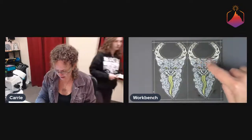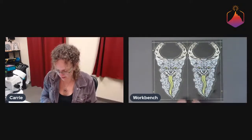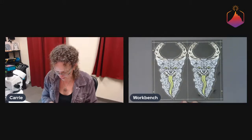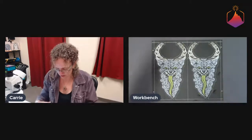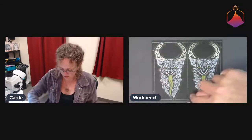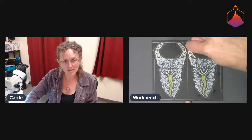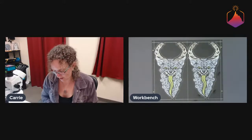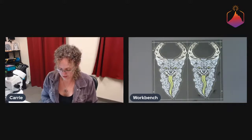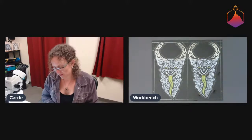So you have tabs there, but then the frame from the panel, in order to minimize that, the frame is really small and it's V-scored to minimize surface area. And also in between them is V-scored also to just minimize surface area and wasted PCB space. If we were going super crazy on this, I would see about nesting them.